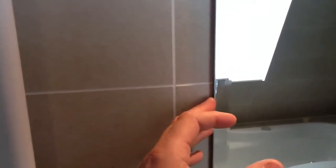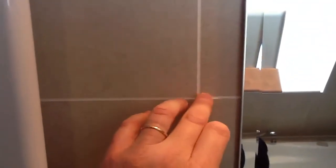When you're fitting mirrors onto tiles, you can either have a bevelled edge or a polished edge. But if you're fitting the mirror into tiles in a space like that, we recommend a polished edge because the polished edge will give a very similar finish to the edge of the tiles.